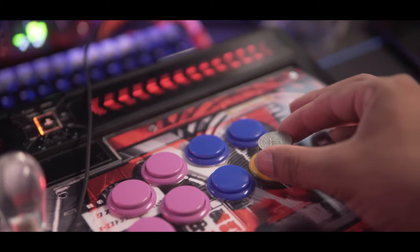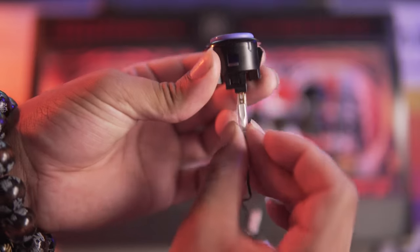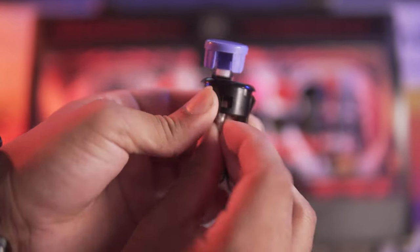With about 6-7 quarters resting on the face of the button, it requires about 35-45 grams of actuation force. Personally, I never had any issues with the Sanwas during play, but I do have some gripes when it comes to mounting and a certain model. The mounting gripe goes to the Sanwa Silent B2s — when you have the pins and you're trying to put them on the switch, the whole switch and plunger assembly will pop out of the button, mainly because it no longer has the tabs on the side to keep them in the housing. This doesn't happen during play, just when mounting — just annoying.